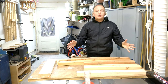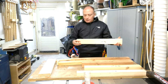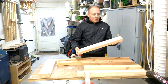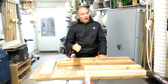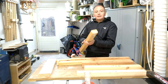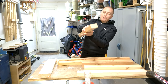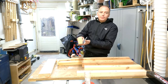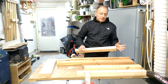The first step in the building process is milling the wood. In my case, working with smaller pieces that are already pretty straight, I still have to cut them to their final thickness and width. I'll use the jointer to make one side completely straight, then the planer to do the opposite face parallel to the first. Then back to the jointer for one smaller face, and finally the table saw for the last face - four perfectly straight faces.